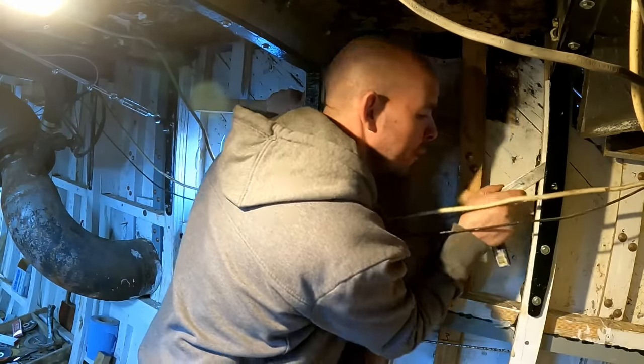Nice and strong. So I think another factor is, when we laminated the web frames, because there's such a massive curve, this one here and this one, they meet each other out, aren't they? Because of the length of the outside one and the length of the inside one, because the inside one's shorter, they're trying to straighten themselves out. So they're constantly fighting. So I go to cut it, remove part of the end of it, it comes off. But it's a force that way, isn't it? So it's sliding. So I think my surface prep could have been better.